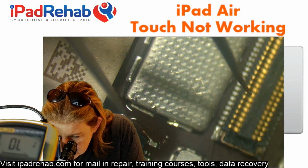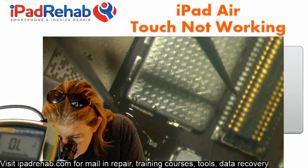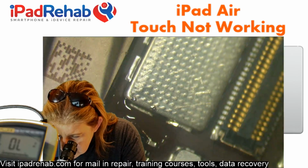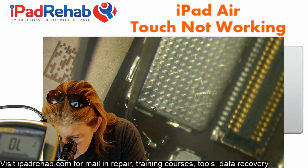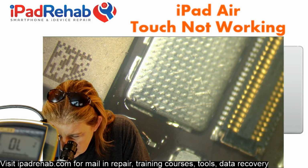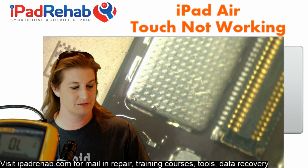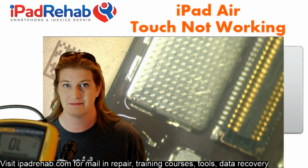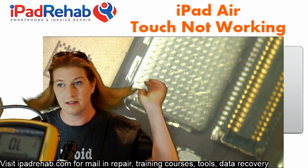Wicking pads is a really horrible idea, and it causes far more damage than any benefit. The only questionable benefit it has, which I really disagree with, is that it makes your surface flat for your chip to sit on. I don't think it's good. It leaves cobblestone pads that are really difficult to get to adhere and make good joints. They don't have little pools of molten solder. Remember, how do the chips get on there? Do they go on naked pads? No, they don't. They go on paste. So if you're braiding pads, at least tin over them. There's no reason to braid pads on iPhones. It just doesn't make any sense. I can't think of any good reason for that.